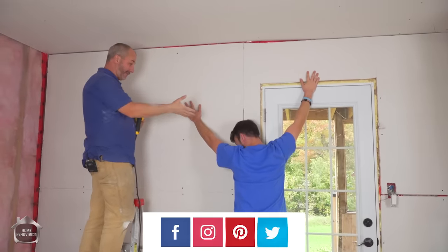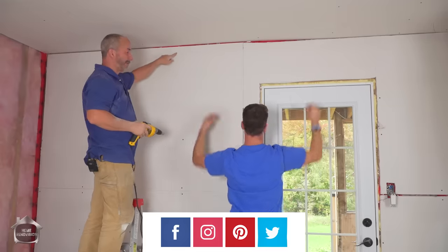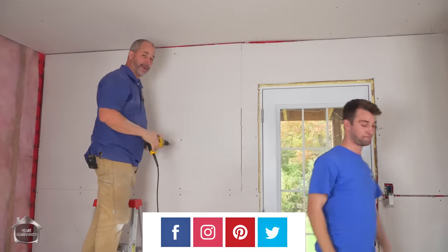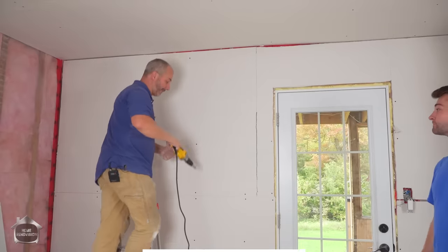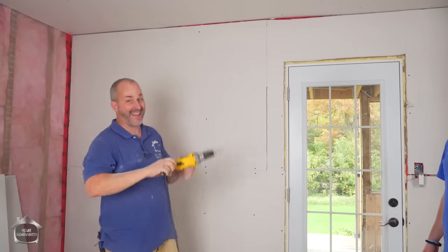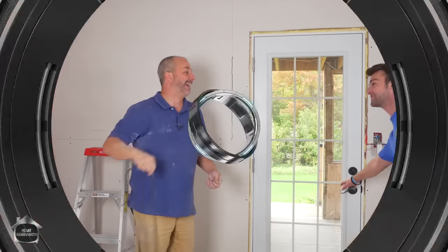So before you let go, you can let go now, make sure you get a screw near the top. Otherwise, if somebody comes in the room and opens the door, the air pressure change will pull the drywall right off the wall. You might not be looking. I learned that one the hard way.